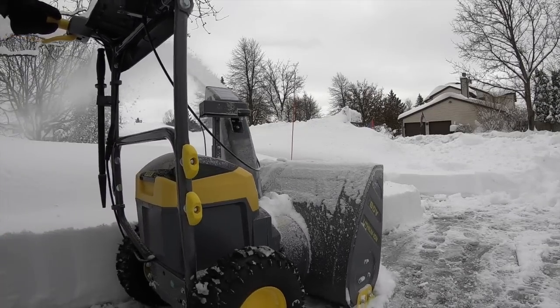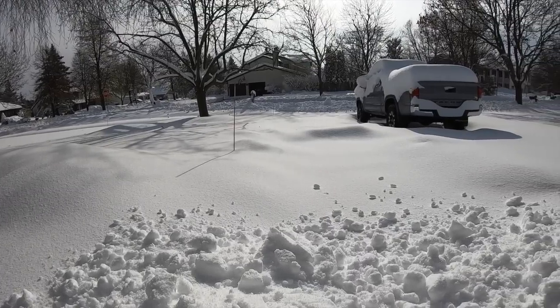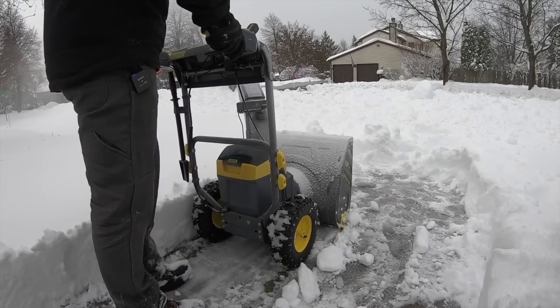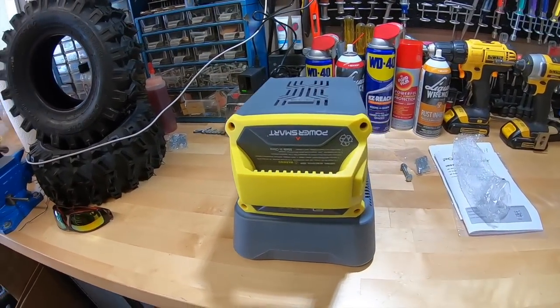Now for this battery blower, here's what grinds my gears. I put this battery blower through the same tough testing conditions as the gas model, plowing through average areas of about 12 inches of snow and higher spots at almost 18 inches — heavy lake effect snow that's a challenge for just about any snowblower. On two separate tests, this snowblower was only able to clear about one third of my driveway — roughly two car parking spots — and after that it really started bogging down a lot. As it started to slow down, it started clogging itself up. After about 28 minutes of run time, she was done and it was back on the charging dock. Obviously your mileage may vary with snow consistency, snow depth, outdoor temperatures, and the age of your battery, but that's what I got with two separate trials with a brand new battery.